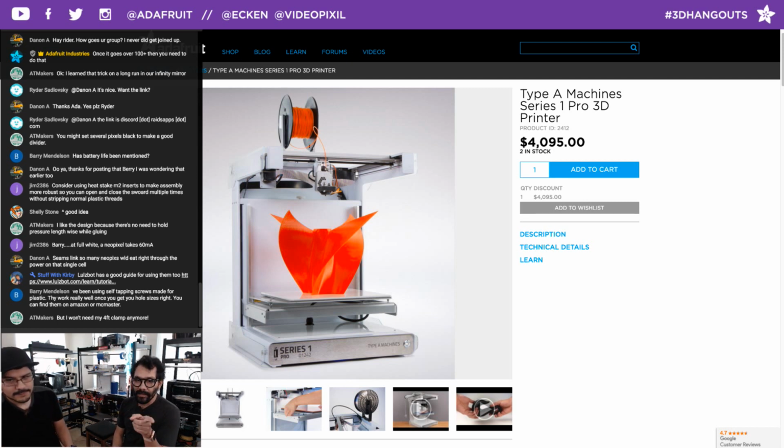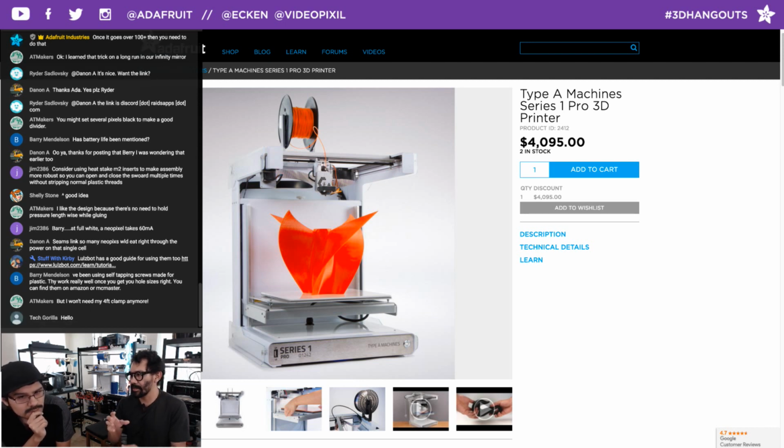Right. The cool thing about it is it's just one screw to lift the cover that's holding the extruder together, and you can see it's literally a nozzle that goes into a tube that goes right into the heat block and into the nozzle. It's all combined, so it's a really good design for that type of stuff. Usually on printers, when you're changing colors, there's some color left behind on the outer walls of the heat break. Yeah. This, as soon as you put another material in there, it immediately changes color. So it's a really cool feature.